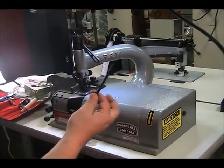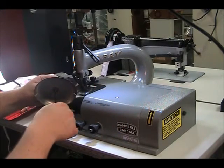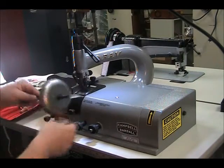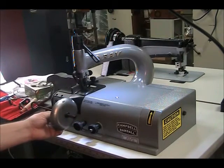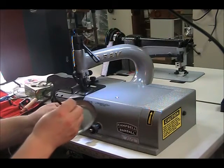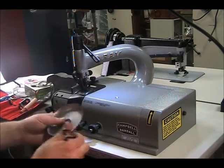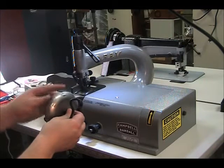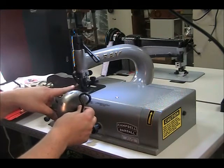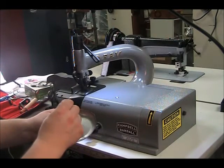And then this guy is a tool used for the ejector. Inside the bell knife is this little cup-shaped device, and that fits inside the bell, and its job is to deflect the trimmings back down the chute so they don't collect inside of the knife. This normally would be set a certain distance from the edge of the knife, and as that knife starts to shrink in size because you're grinding it away, you'll have to periodically push it back, and then when you change the knife you have to pull this out together.